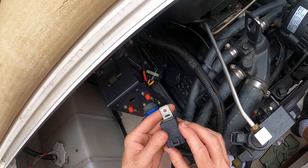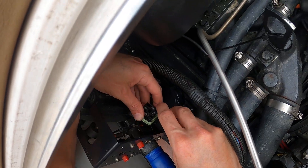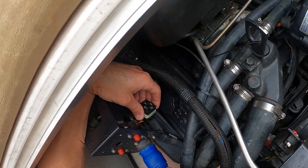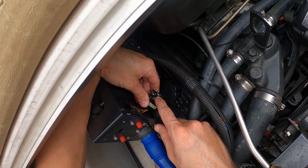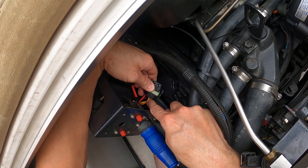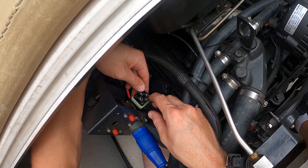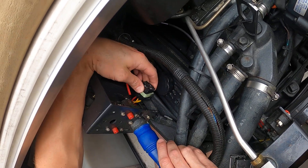To identify all this and locate it, it's basically point-to-point measurements. At this location right here, I put an ohm meter from this terminal all the way down to the terminal lug on the starter where the yellow and red trace wire goes, and I got an ohm value that was next to nothing. Then I put a voltage setting on the meter and measured from the signal wire over to black or common, and when turning the key I saw 12 volts there. I also measured from the constant positive to the negative and confirmed I had power at this plug.